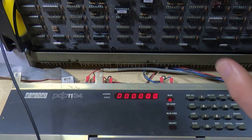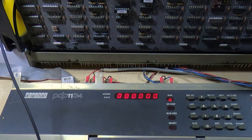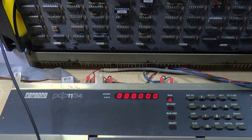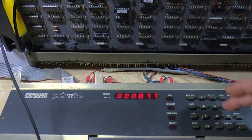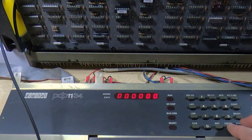I don't think it's going to boot successfully because I don't think 16K is enough RAM for RT-11 to boot, but we'll give it a go. I've got a disk in the floppy drive. Rather than changing the jumpers on the bootloader, I'm going to try running directly from the entry point of the bootloader PROM on the bootloader card, so I'll enter the address 773004 and try to run this — fingers crossed.